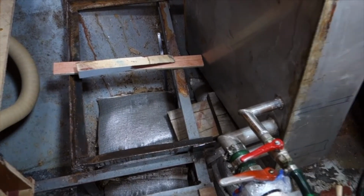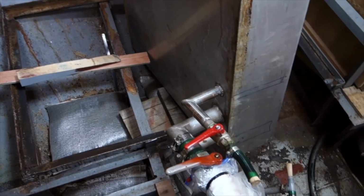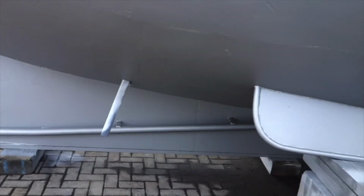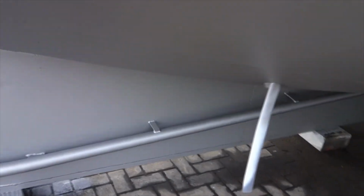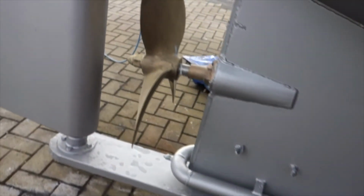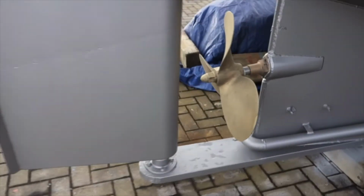Oh my gosh, that was a job and a half. That probably consumed at least 2 full days. While I was spending days and days inside the boat fighting the holding tank and the toilet, we were busy grit blasting the hull. So we got some 3 coats of primer and epoxy primer on top of it. The business end.